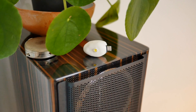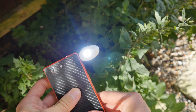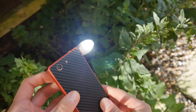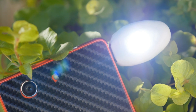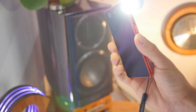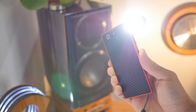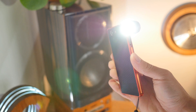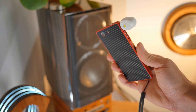You can now keep it in a convenient location, and when needed simply plug it into your phone for a ridiculously bright source of light. As it's drawing 2.5W it can get warm after a while, but as LEDs draw more current the warmer they get, it should push past the 500mA mark and trigger the phone to cut the power — like an automatic over-temp shutdown. Pretty neat. It does take a while to reach this point, but it's quite a nice unintended feature to have.